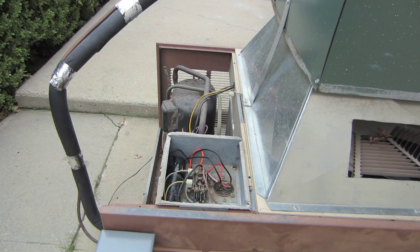Here's my demo condenser. I've disconnected the condenser fan motor so only the compressor is going to run, so I can show you the difference between a conventional contactor, a conventional time delay, and a Sure Switch. The conventional time delay only time-delays the 24-volt side — it doesn't do anything for your 230-volt side.